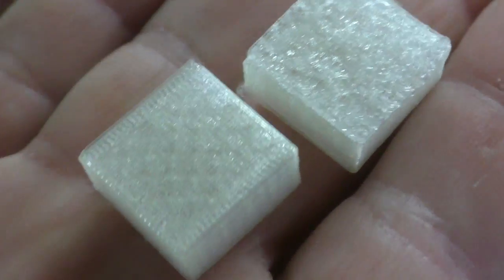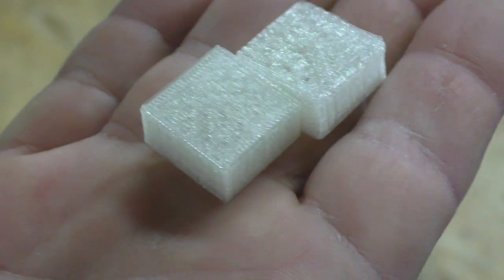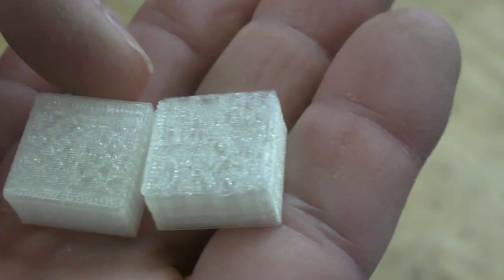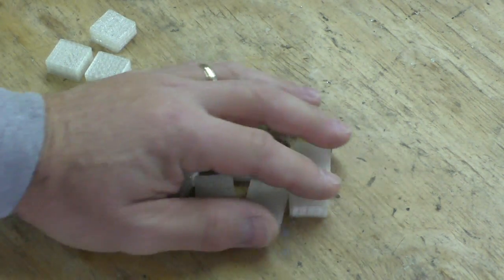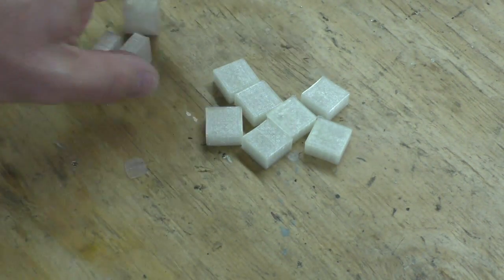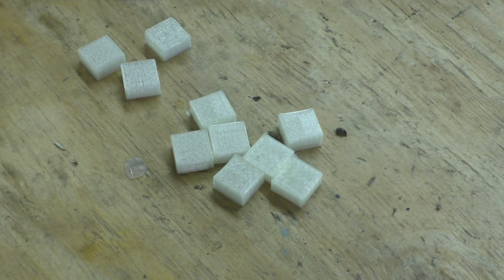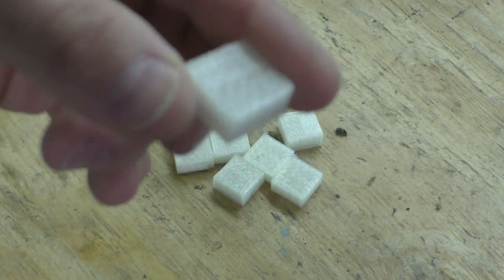Here's a good cube, and here's one that's rough on top. I think the filament got too thin. What I did is run it in manual mode and just kind of eyeballed the calipers, making adjustments as necessary, to eliminate some of the variables. All these cubes printed fine. I let it run for about five minutes in manual mode and it made enough plastic — all the metal flakes are gone, all the trash that was in that setup is gone, and it made really good usable filament.